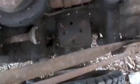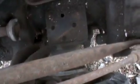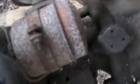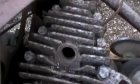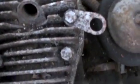So it's got the small air cleaner on it. It's missing the magneto, and the coupler that was on it was like one of the ones from a Wico, so I think it had a Wico magneto on it. It actually has the other bolt holes, so you can put a Fairbanks Morse on it. Like I said, small air cleaner, canister type oil filter. Unfortunately, the plug was removed from it some time ago and left like that, but surprisingly enough, it still rolls over. No compression, but rolls over, which is a plus, so at least it's not seized up or anything.